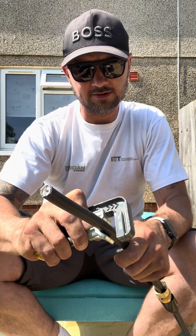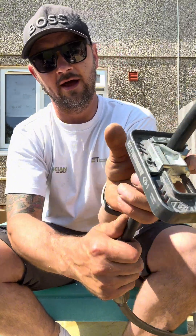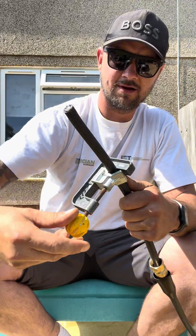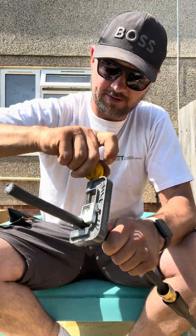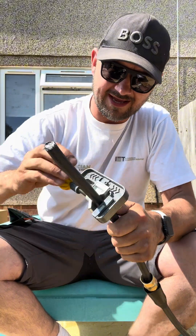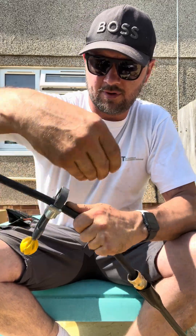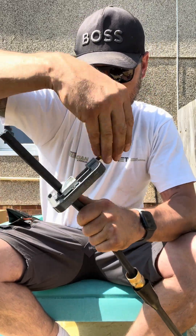I want a little bit to go into that box. Do it up just so it pinches and it's got on there — which way to rotate it, look. So I'll rotate it that way, tighten it up as we go. So grip it, tighten it up all the time just so it scores that armoured. Basically, with this you get a perfect score around the armoured, enough to bring it off. So I'm going to score it all the way around and then you can see the bits of metal come off.